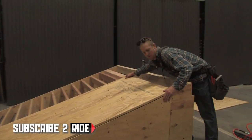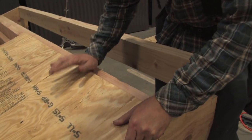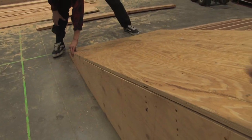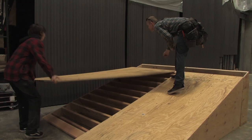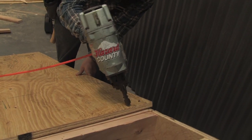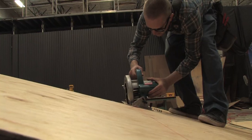The first thing you want to do is square your ramp with your four-by-eight sheet of plywood. Basically, what you're looking for is your lines right here. I'm going to use the line right here all the way down — this right angle line right here. I'll make it identical to my edge. We add a little extra foot right here to make the bank mellower. We're going to go ahead and cut this chalk line at 20 degrees with our skill saw.